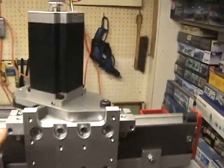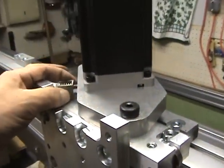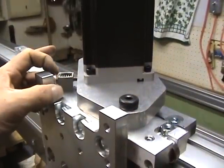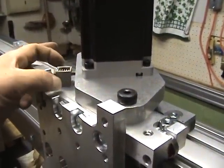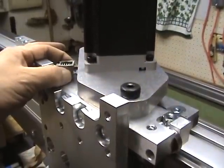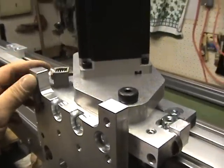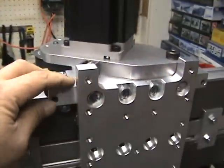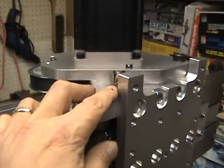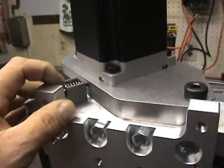The other issue I found was with the tension adjustment here for the assembly. They supply you with a socket head cap screw, a washer, and a spring. Then there's another bolt that goes underneath here to hold this in place. You have to make sure that this is kind of snug in a turned position. The issue was that when you put this all together, you can see there's no way to get an Allen wrench in there to the head of the socket head cap screw. So the option was using a pair of pliers to try and tighten it up.